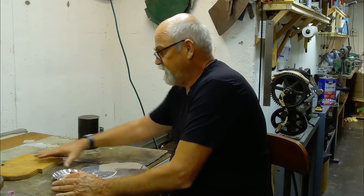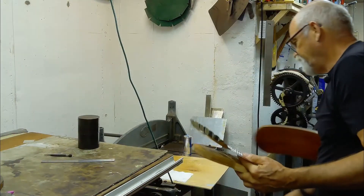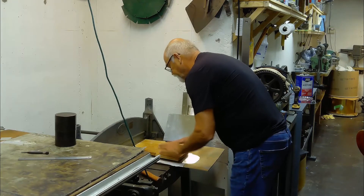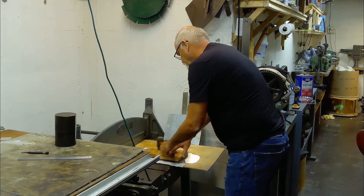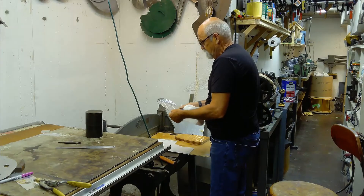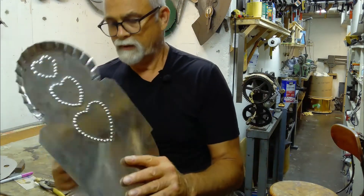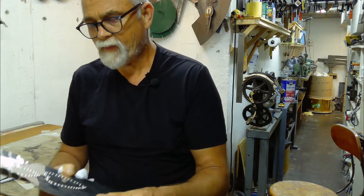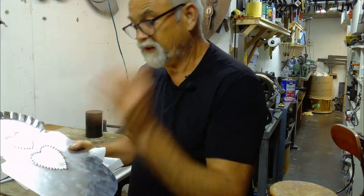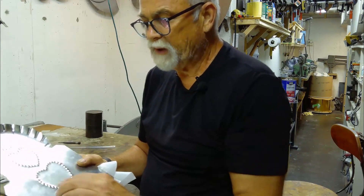This is a little bit of an art — I'm going to take my hammer because you want it to pull in decently and lay fairly flat. It's pretty well out of whack, so I'm going to go over to something that's fairly solid and hammer it. That's about as good as you're going to get. The next step is to take this over to the bar folder and fold it so I have a hem here. We've done that on a few occasions so I won't show that step, but I will show you putting the swedges in.